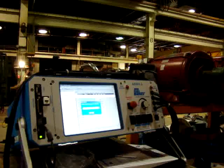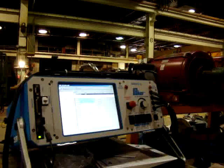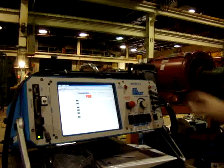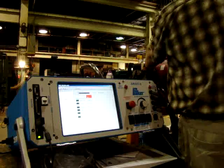We're going to do this as a 230 volt connection. We're now set up to do the 230 volt testing — all the motor data is entered. We go to tests, already set up for resistance, mega test, dielectric absorption only, hypot to 700 volts, surge to 700 volts. Now connect the leads and ground.